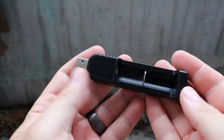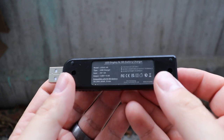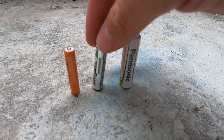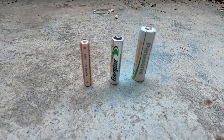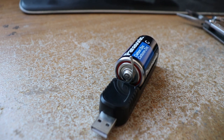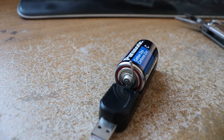Aside from the company having a funny name — Pickle Power — I found this to be a good solution for backcountry electronic kits. Because AA, AAA, and even C and D cell rechargeable batteries all have the same nominal voltage of 1.2 volts, this little USB charging tool can charge them all, sadly only one at a time, and you'll need some sketchy DIY attachments to make it work on the larger D and C cells.